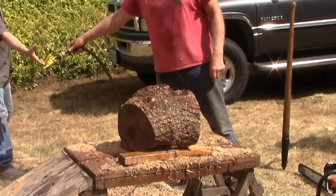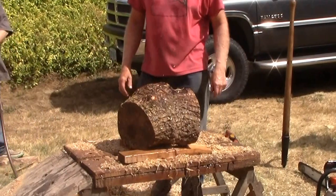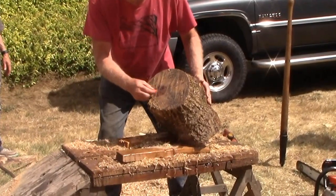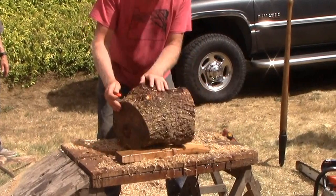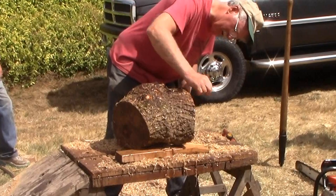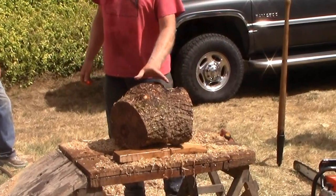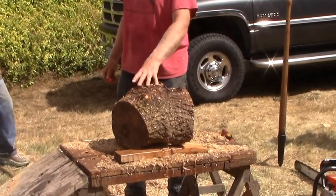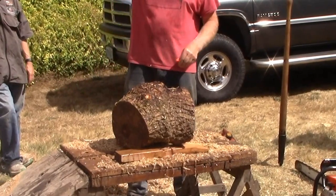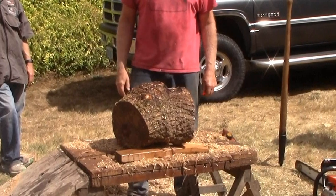It won't be very deep. It's all sapwood. So you can look on this end. Here's your pith, and we'd have to cut a couple inches off that end. This end's not quite so bad. Pith is clear up here. It could be either a heel burl over a limb, or it could be burl. But if it's burl, it's not very deep. It's only about that deep. So it ain't worth much.